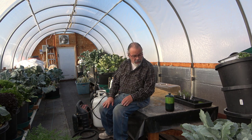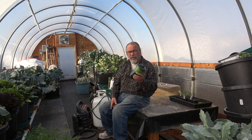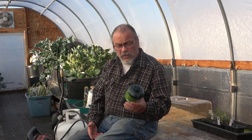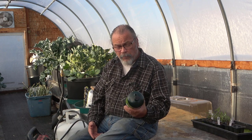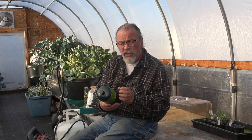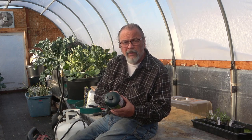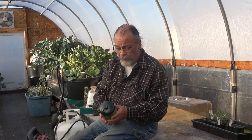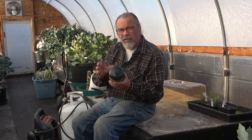Let's talk about some alternatives. There are people who will tell you to just refill this cylinder. Can you do it? Sure you can. Have I ever done it? I'll admit to it — it's kind of a convenient way and it's a lot cheaper. But did you know that these cylinders are not approved for refill? The reason is pretty simple: these cylinders have much thinner steel than the large barbecue cylinders, the five and seven gallon tanks you might use at home. The problem is every time you fill and empty one of these containers, the sides flex.